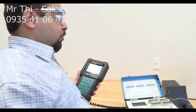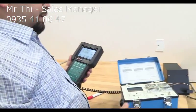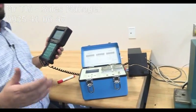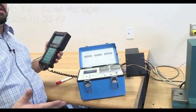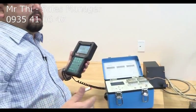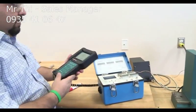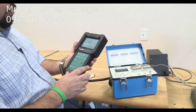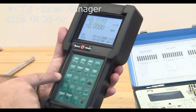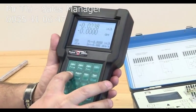And I always prefer for aluminum 5 degrees increment, maybe the first 10, 15, and then switch to 10, and then switch even to 20. For steel, I do most of the time 10 degrees increment, and then switch to 20, and then maybe later even switch to 50 if you have the plastic region. And the way you do that, it's really very simple. This is high clutch and low clutch. You can do either. So I'm going to do high clutch.